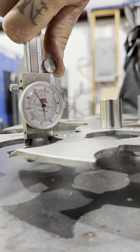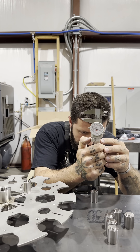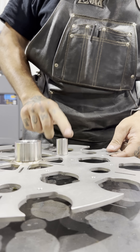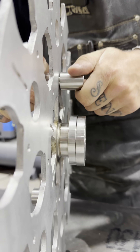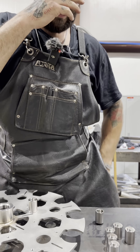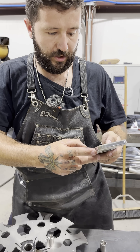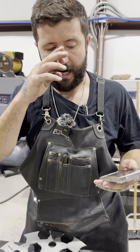Material thickness is 0.188 — so it's like three sixteenths. The depth of this piece is 0.122. What's happening is whenever you put these in, these fit really well in the hole. So whenever you fit that in the hole and go to put this on, I'm shoving these things together and there's a gap of about a sixteenth of an inch, a little more than a sixteenth. We can do the math: 0.122 times two is 0.244, minus 0.188 — so we're 56 thou too large.